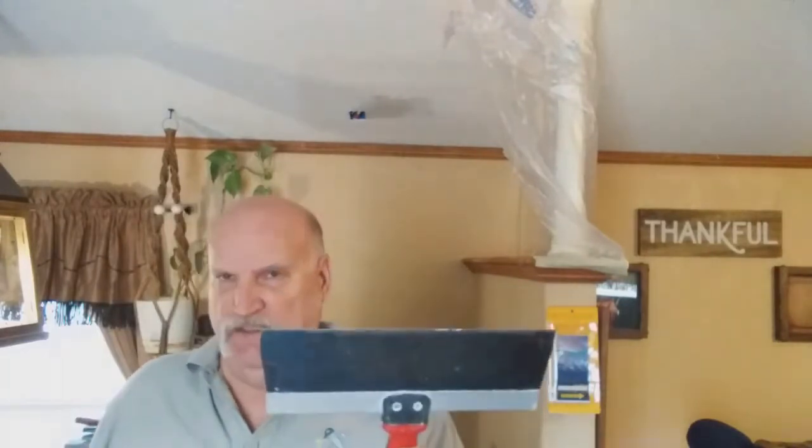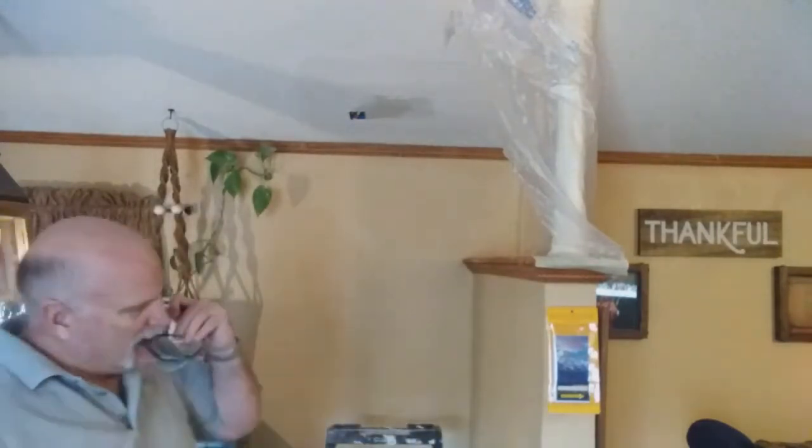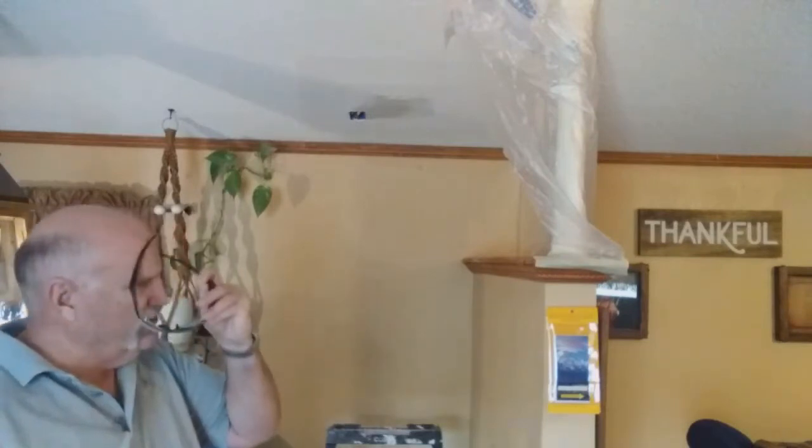third drywall putty knife. Okay, and I've already mixed up my mud, and again, you want to use a whole width of your knife of mud on it. If you do parts of it or half of it, it's not going to get you the same thing that you need. So let me get my safety glasses on here, and let's go ahead and get this third coat of mud done.